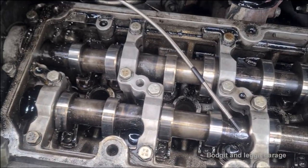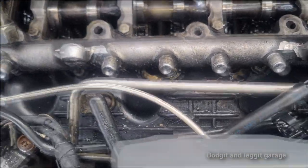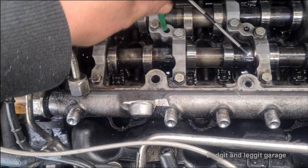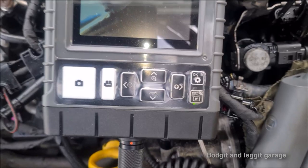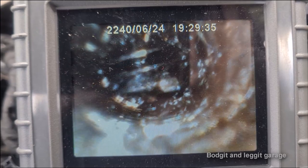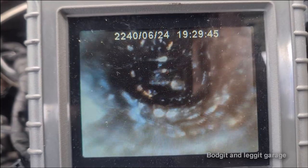I had to stop when I wasn't complete. We need to be this far in and at the minute we're about 10 mil away. The drill bit felt like it was just about to snap — it kind of caught and grabbed. So I turned off my light and looked at the scope. Half the bolt had managed to somehow turn and got caught in it. Without the scope I would never have seen that, and I guarantee you would have snapped the drill bit in there and then you're in a world of trouble.